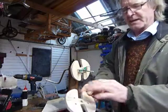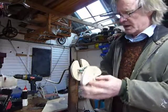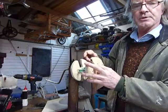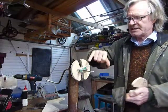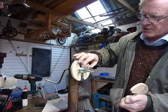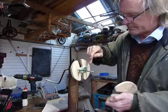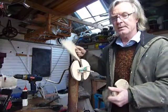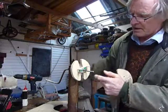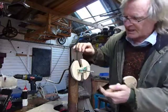I started off by drawing that shape on one piece of ply, cut my hole centres and punched them, and then I basically just drilled through into another piece of ply that was cut out to the same shape. For the centre spacer, I drilled through before cutting this piece into that tapered shape — just drilled through into a scrap piece of ply, drilled the 4 holes, and then afterwards cut between the centres of those holes to make my spacer.